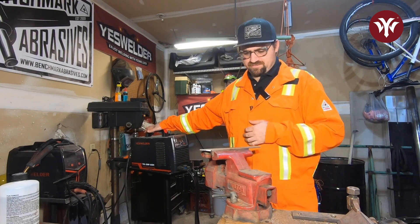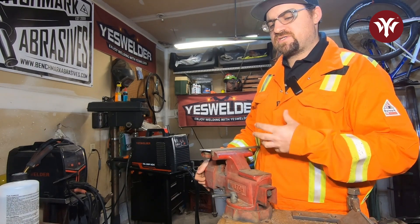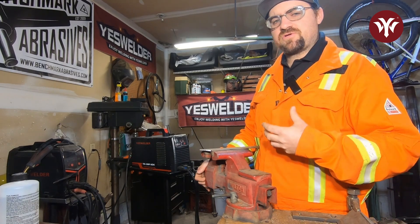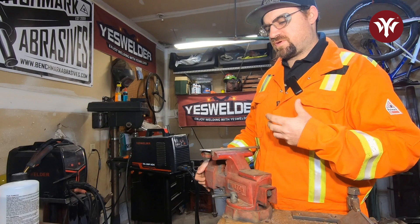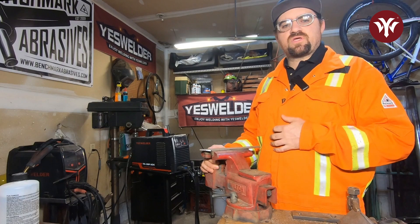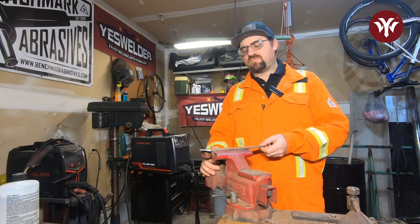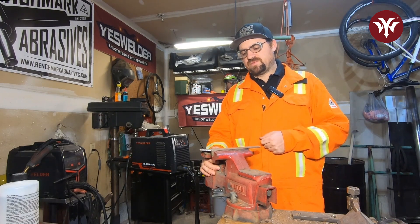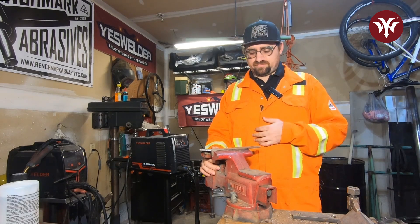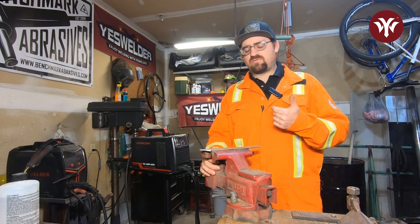But today we're going to use this. The reason why we clean off all this metal before welding is because this rust and mill scale can create an oxidization layer that is really hard to break up in welding. It'll result in decreased weld strength along with a plethora of discontinuities and defects that can cause the weld to be pretty weak. The rust also diminishes the fusion properties of the metal, making it much harder to melt under heat. So if you just try to weld on mill scale, the weld may just lay on top. I'm going to show you the two basic methods to clean metal: hand cleaning and power cleaning.